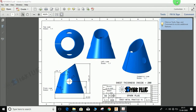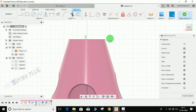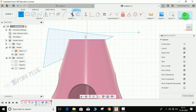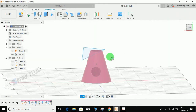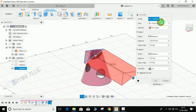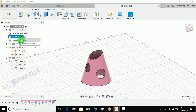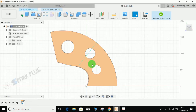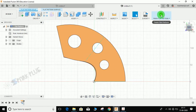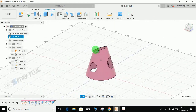For a simple cut, click on this line and draw a line from here to here — I'm doing this roughly without dimensions from the drawing. Click Extrude, select two-sided or symmetric, and press OK. Now activate the flat pattern and you will have your complete flat pattern created. This is how making a cone in sheet metal in Fusion 360 works.